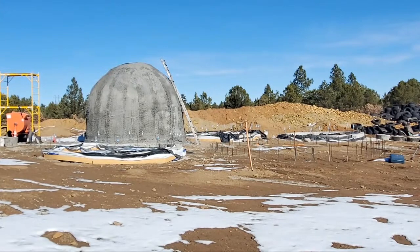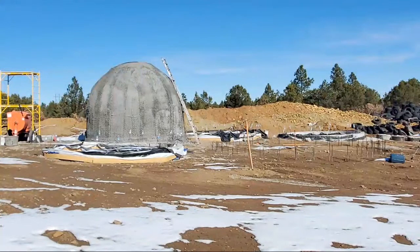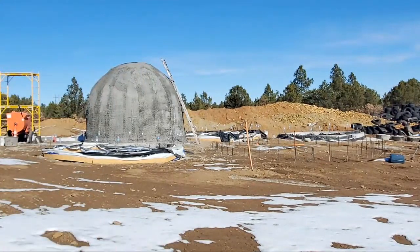If I were going to do aircrete bricks for where I live because of the amount of cold, I would go 12 inches — that's what would make me happy. 12-inch thick bricks is what I would mortar on to my dome in my cold climate area, because concrete is still a thermal bridge. So the thicker the aircrete brick, the better — it'll take even longer for it to act as a thermal bridge to come through. Besides that, you're going to have heat on the inside.